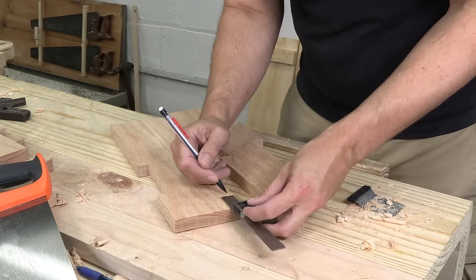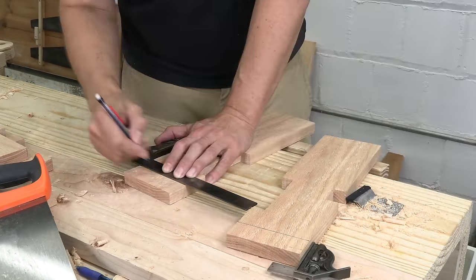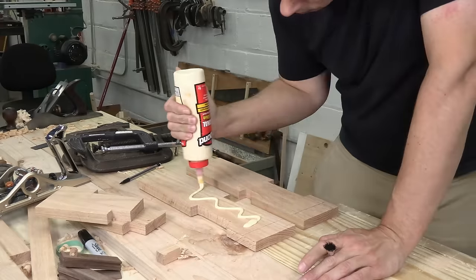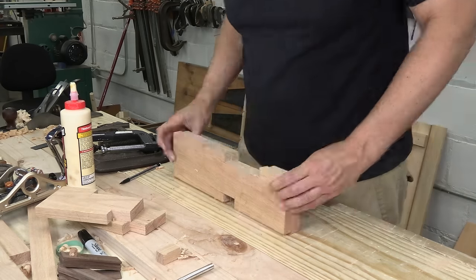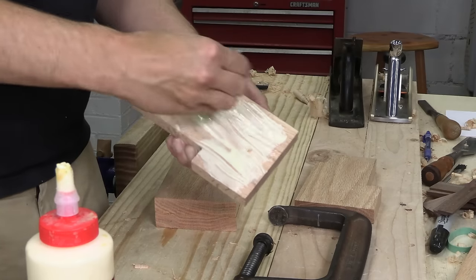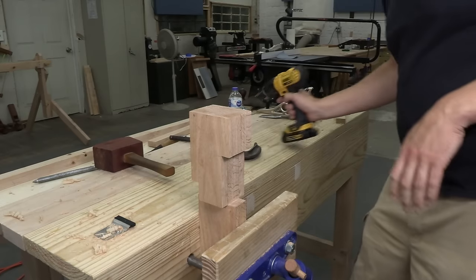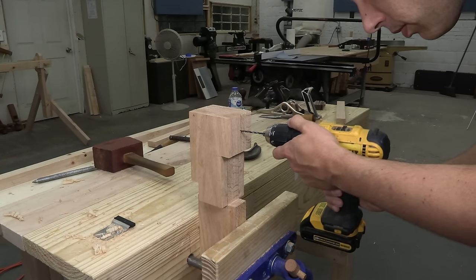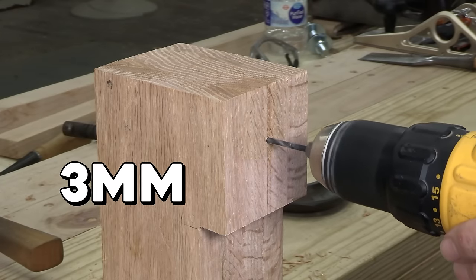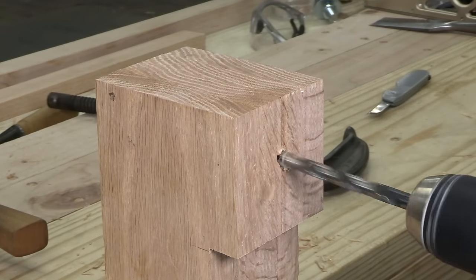To get that hole drilled straight, I'm going to lay out the screw location on the inside of my two pieces. Once I have a clear line to follow, I'll saw gently across it to create a shallow groove. I do this on both pieces, and when I glue them together, I get a pilot hole in exactly the right location. I also made two more pieces that I glue on the outside to complete the poppet. To turn my pilot hole into a full-sized hole, I just drill it out from both sides. I start with a one-eighth-inch drill bit and move up slowly, gradually widening the hole while keeping everything perfectly straight.